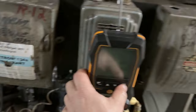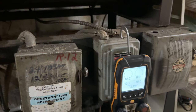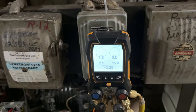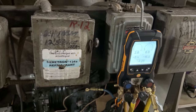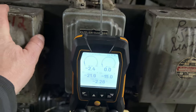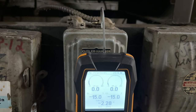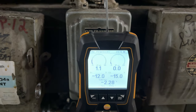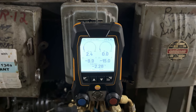We're going to run that down a little bit more because the pressure has built back up again. If that thing is fouled off, you're trapping it from the liquid line through, so it has to pull through the other units. We'll probably have to run it into a little bit of a negative to get it to stay down to one or two PSI. I'm not going to get gassed out underneath there. It's a game you've got to play with these old beasts. Here we are at negative two. It should come right back up again — it's still got some bleeding through, boiling off.